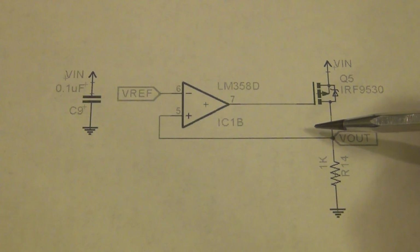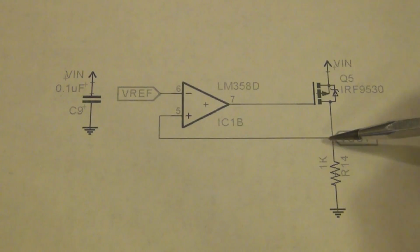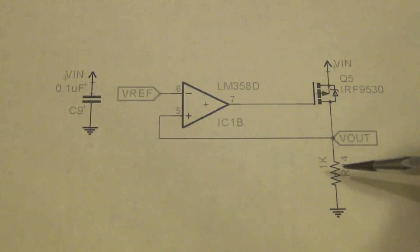Normally, an IV characteristic of a voltage regulator like this will be done in 2 dimensions, which means that it will sweep the output desired voltage versus output desired current, and you will get essentially a 3-dimensional plot telling you the performance of the voltage regulator across all of the voltages.